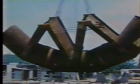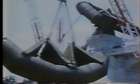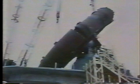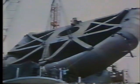The next and second yoke piece is the bottom counterweight section, which went on as soon as the hub was bolted to the sphere. Again, the trick is to pick up the 110-ton bottom section at the correct angle so that it will butt up exactly with the center yoke assembly. This is the section of the yoke assembly which will receive 700 tons of concrete counterweight and steel ballast. The lift turned out to be one of the easiest. The match between the 2 sections was good, and the section previously pre-fitted on the ground was quickly clipped and tacked in place.